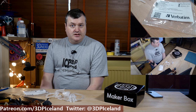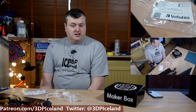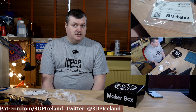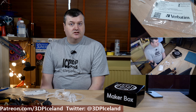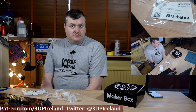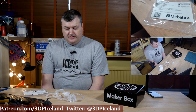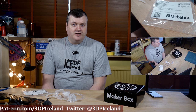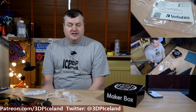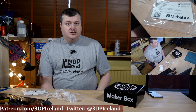With bed adhesion solved using packaging tape I could get pretty decent prints, but I may need to tune retraction settings a little — I was getting some artifacts. I had no issues regarding strength and layer adhesion was very good, so I was quite happy with this filament. However, I now have the pain of removing the packaging tape from the bed, which is quite a task to clean up again. Thank you for watching and I'll see you on the next one.